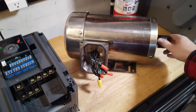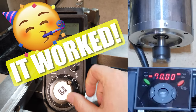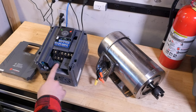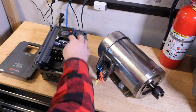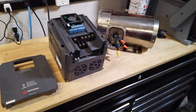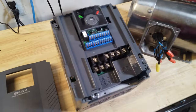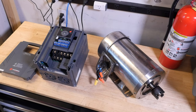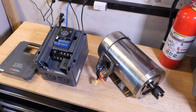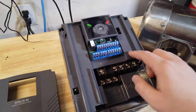In this video, we're gonna try running this three-phase AC motor on single-phase power with this VFD. The first thing we're gonna do is hook single-phase power into the VFD, see the LEDs light up, maybe scroll through some parameters, and make sure everything looks like it's working. Once we do that, we'll hook the motor into the VFD and see if we can bump the motor with the keypad on the VFD alone — no external control source.